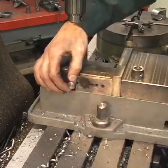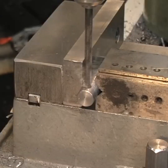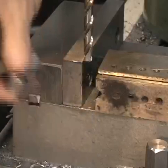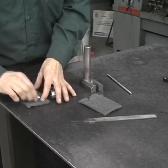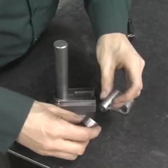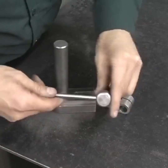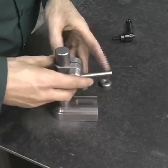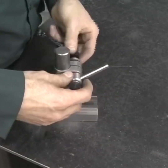The last part is the cross pin — we've already discussed all of the techniques to do this. I simply drill a cross hole in it, and that completes all of the pieces. Let's head over to the bench and put it together. I use a file to lightly deburr any edges that need it, then a Scotch-Brite finishing pad to add a nice finish to all of the components. The cross pin gets the bushing, then the locating shaft goes through, then we have the knuckle. We put the knuckle on the post and use one of these locking levers — we use these quite a bit in the shop on our belt grinders and for fixturing.